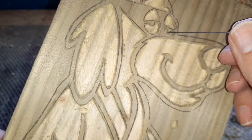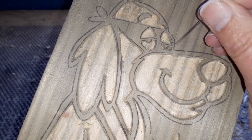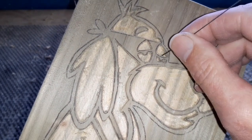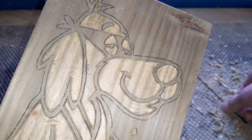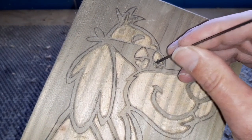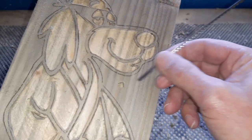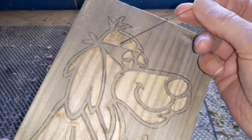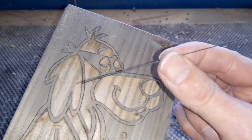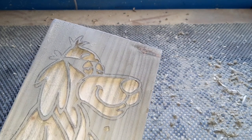You imagine we wanted to cut out the centre of that hole, that eye, should I say. You'll drill a pilot hole, put your little blade in there, and you could cut out that piece if we wanted to. A scroll saw project, where obviously with your pin blades you wouldn't fit that because the pin would be in the way. So pin blades for larger outer cuts, pinless blades for really detailed work, plus the outside. Obviously some people do some fantastic work with those straight pinless blades. I just prefer a spiral blade.